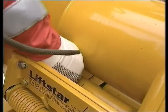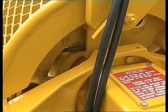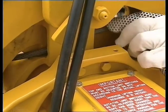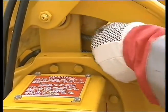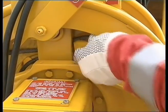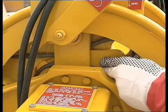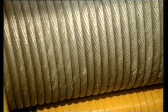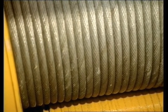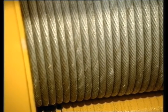When spooling the wire on, the wire is fed under drum, through a locator hole and anchor part on the drum, and looped back around an anchor block, which provides a truly secure anchor to the drum. This model is also fitted with a spooling device to provide better winding of the rope under no-load conditions, which also minimises the risk of damage to the rope from bad spooling.